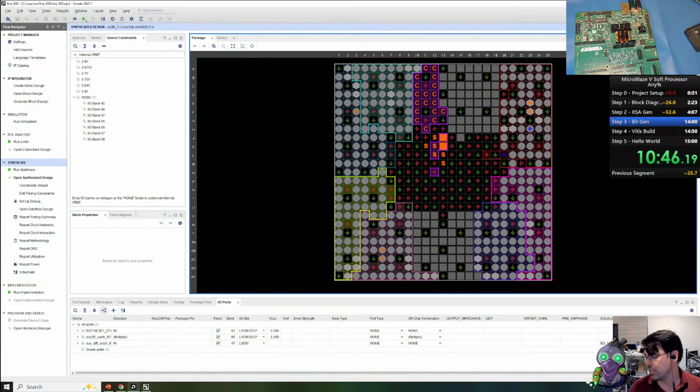But you can instantiate multiprocessors, do your own mailbox system. There's nothing preventing you from doing multiple instances of the processor. Okay, thanks for the question. Oh yeah, you can modify the memory spaces for each processor separately. Yeah, you have that fine grained control over the processor.